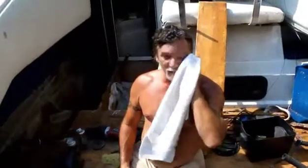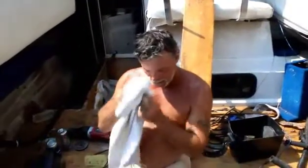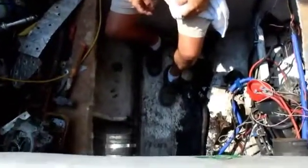So today I chose to come out here at the hottest part of the day, which is 3 o'clock in the afternoon, and start work on the big boat and start getting the motor mount put back in. Got the piece right here behind me. This is a 2x12, I believe it is. Yeah, 2x8, something like that. This is going back in the hole that's gonna fix the problem that I had with the one that was all rotted and decayed and nasty. As y'all seen in previous videos, I've got plenty of glass. I've just got to pick up some resin this weekend and get it resined up, and put resin on this board so it's completely waterproof.